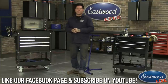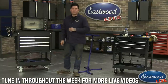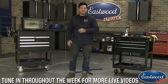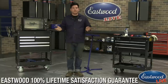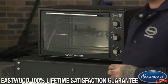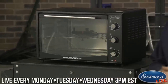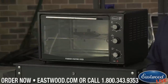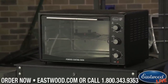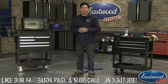We've got about 10 minutes left on this and then we're going to be able to pull it out. You guys could see how quick it is — from spraying the powder to putting it in the oven, we're already flowed out. The part's pretty much done at this point. You don't need to watch your oven constantly — if you've got a timer like on the Eastwood powder oven, it'll just ding and shut off, then we can let it cool and we're ready to go with the part. We can pull the silicone plugs out, put them back in the bag, and use them again. Hopefully this helps you guys be a little more informed when doing powder coating if you're just trying to get into it.